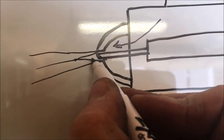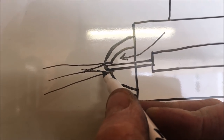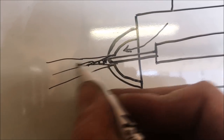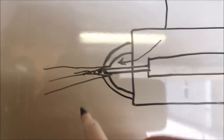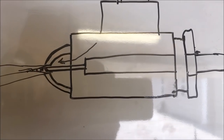What happens right here in the shock cone, you can actually see this cone, by the way. There's a high vacuum in this little void that pulls the oil out of that spout. It will self-siphon, but we are going to be using oil induction. We're not going to use siphon. Induction is a little bit more controllable than siphon. Siphon requires very specific geometry to function properly.